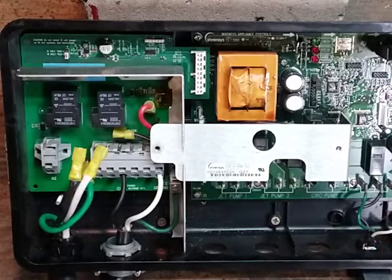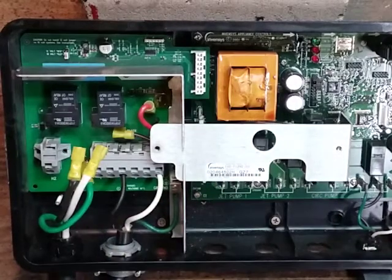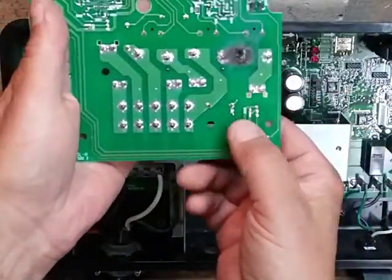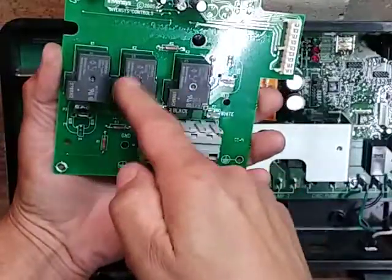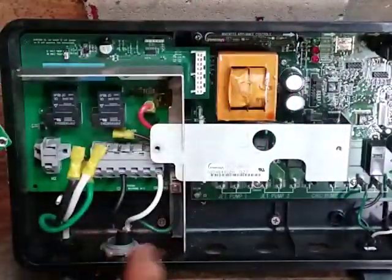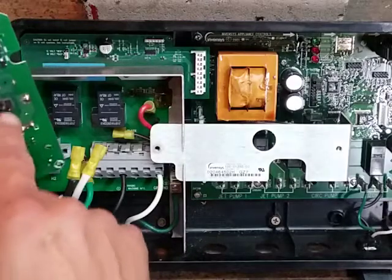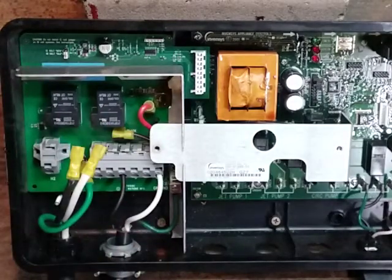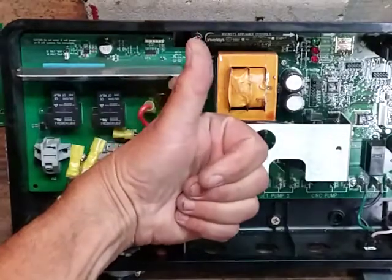I just replaced a heater relay board — and oh, I didn't show you that. That's the old relay board. Boom! Blew out the solder job — that's why it failed. You'll often see soot in here along with the blown solder. You might even see some white grayish dots down here where the solder blew out and made little white solder stains. But there it is. I hope you learned something and if you did give me a like. Thanks!